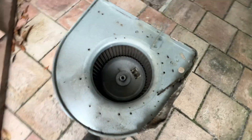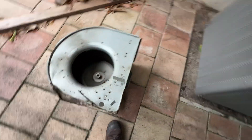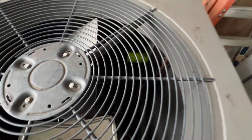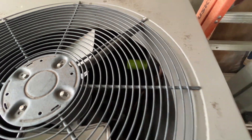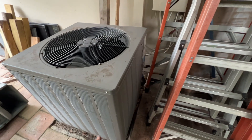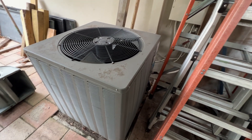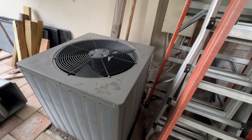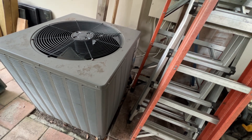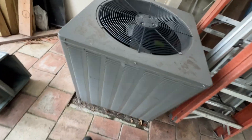All right, I got the motor out. While we got it out we might as well give it a little bath, right? Definitely a little dirty in there. As you can see, the condenser does not match — they've had some work done to it. This is actually a new customer, referred by another customer. He didn't want to change out the air handler. The air handler was going to cost three times as much as doing the OEM motor. Good grief, the thing costs four times as much as what I'm going to put in there. So he wanted to see if he can get a couple more years out of this system because he knows there's changes coming to the industry.